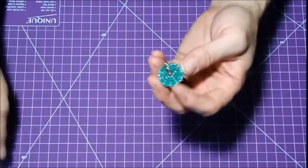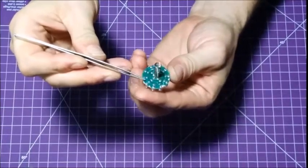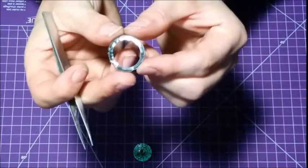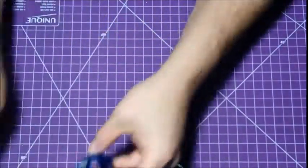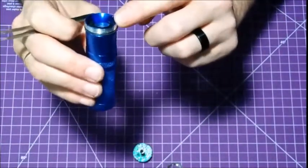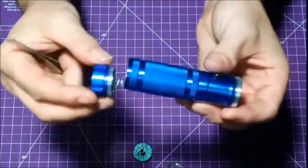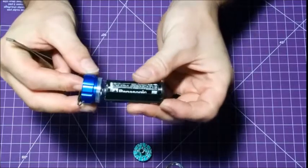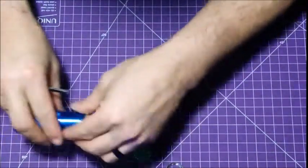Now, the way this works, this outer ring of LED legs touches this metal ring, which touches the housing. The housing touches this, which touches the end of this piece, which is your back. And this will touch the negative side of your battery pack. I know it's a long way. You don't really need to know that, or you can if you want. So that's how that works.